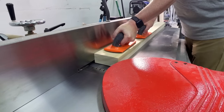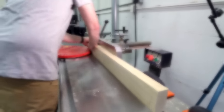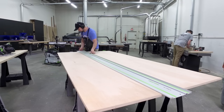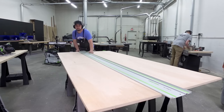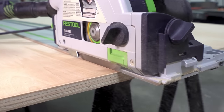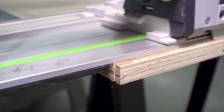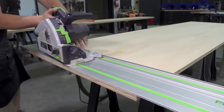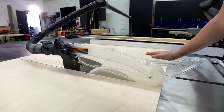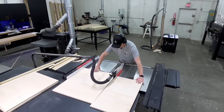Now the individual boards can be put through the various milling steps, and while Cody does that, I'll start cutting the 3-quarter sheets to rough sizes. This is 3-quarter or 18mm birch veneered plywood. They can be refined on the table saw, but we're still leaving them a touch oversized. Two of these plywood panels are going to be glued together to make a thick inch-and-a-half or 38mm panel.